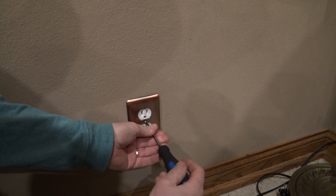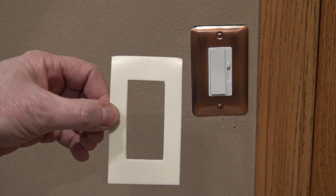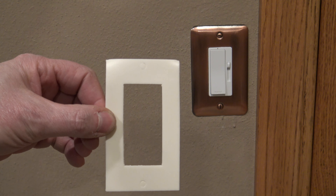I'll head back downstairs and throw the breaker on so we do have power, and I'm going to wait 30 minutes and then shoot the temperature again to see if that made any difference. If you have a toggle switch like this that controls the lights, you simply punch out the rectangle on the insulator pad and it will slide into place and reattach just like the receptacles. These have a lot of different varieties and will fit all different makes and models. I'll put a link in the description below on how to get these on Amazon.